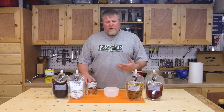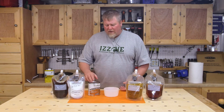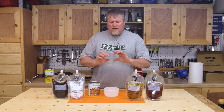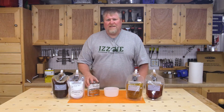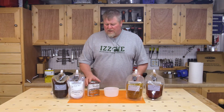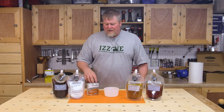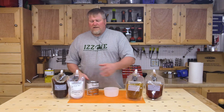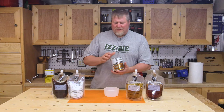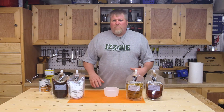The reason is when you open one of these cans you end up giving it a little airspace. The more you use, the more air that's in there, and over time you're gonna end up with a skim of hardened finish. Also, when you pour out of these cans you always end up with a little bit of polyurethane in the lid, and eventually you're gonna end up with a cap that won't go back on unless you're very diligent about cleaning out that rim.